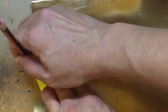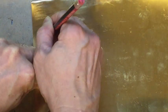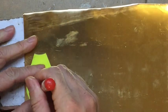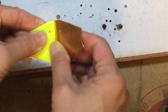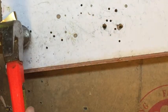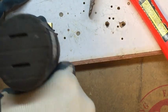To fix the plate that is folding, we need to cut out this mock-up plate, which has two fixed plates in one position, and you have the middle slot there, that is the place where you need to do the folding. So you need to mark it clearly. You also need to mark the place where you are drilling the holes. Cut out the parts, then use this mock-up 3D printer part to do the folding. After that, we need to hammer it to make sure it's folded nicely. Then we can drill the two holes.